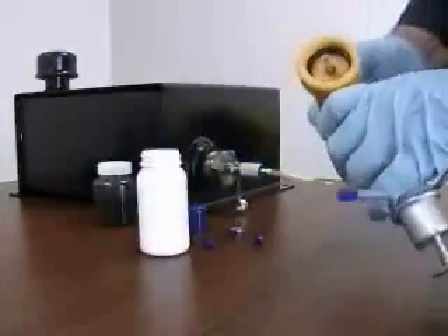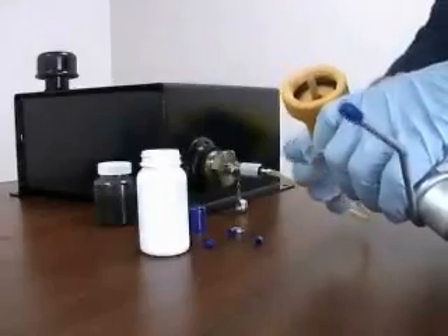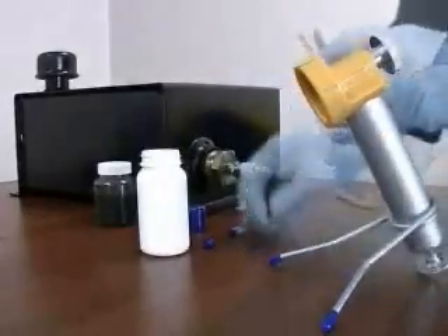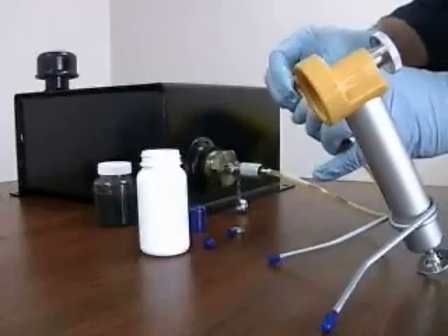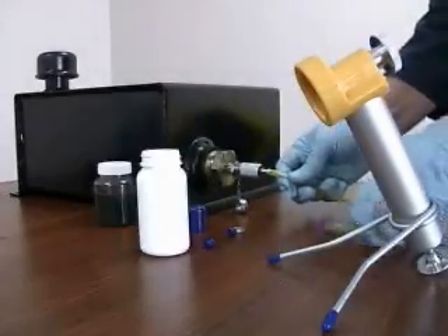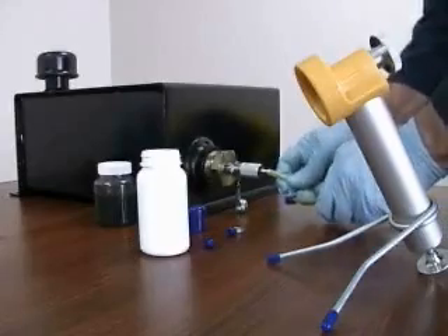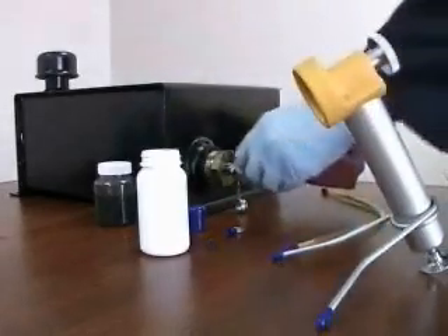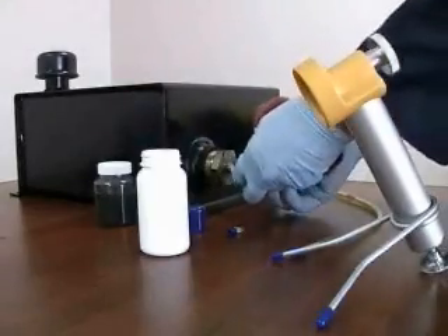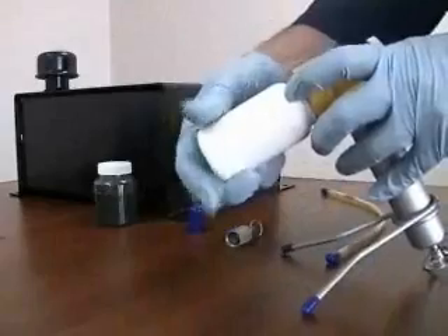To keep your pump clean, invert the pump and pull the tubing from the bottom. Hold the open tube upright and cap the end to prevent any spillage. Remove the tubing from the probe adapter end, cap it and dispose. Remove the probe and wipe clean the valve and re-cap. Next, wipe clean the probe adapter and the pump and store in a clean environment.